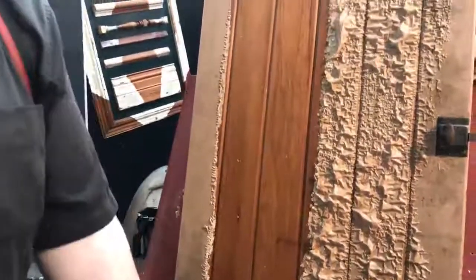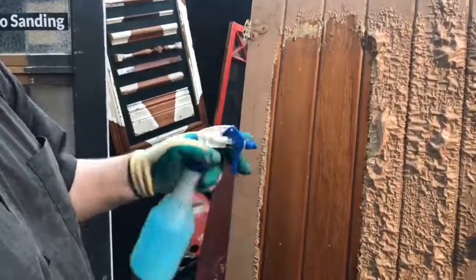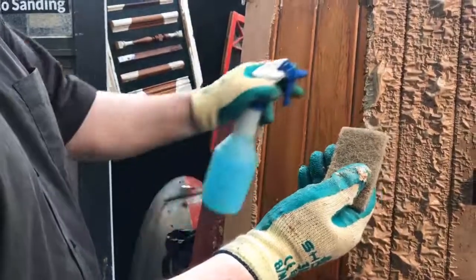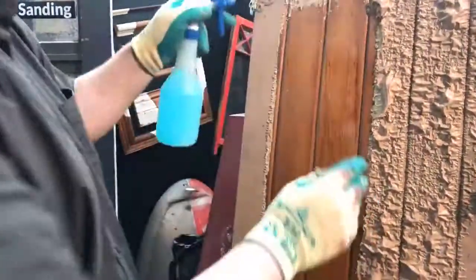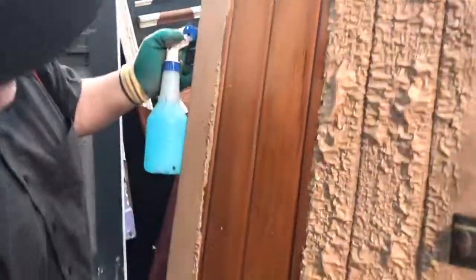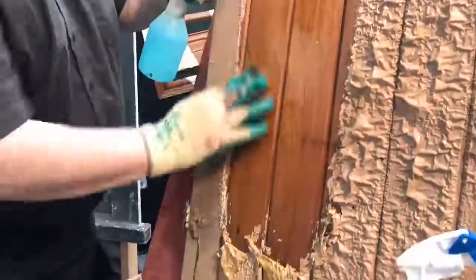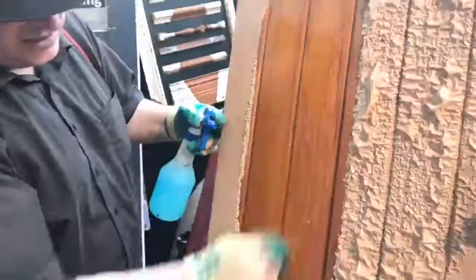Part 3 is where we use this blue one. This is our flusher — it's a rinse to get rid of the residues. We've also got this pad which has got a grit in it, and it gets into the little sandpaper marks like a record player needle in a record. So you watch this — we spray, then we scrub, spray and scrub. And this is rimu — part rimu through there, a little bit sappier, but it's all in really good order.